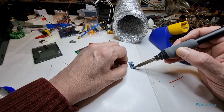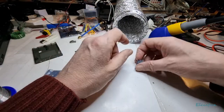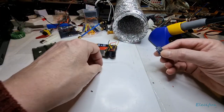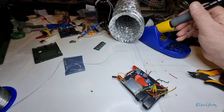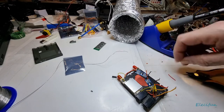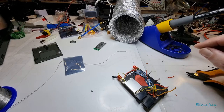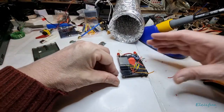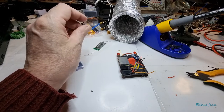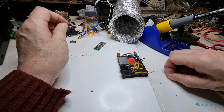Now, I've seen that there's been quite a few people struggling to find the function code, timer H. So I've located it and will share that. And if you're going to buy the OSD receiver, consider the sensitivity. Now, I believe on the FR632, the sensitivity is minus 92 dBm. And that's pretty good. That is pretty good. And you know, another 3 dBm, and that'll be quite a big boost.